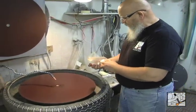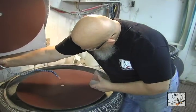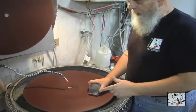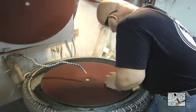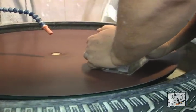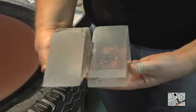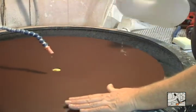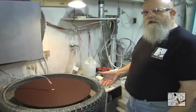I'm going to change direction so I'm sure I'm getting adequate coverage and grind. For an older pad I'm going to use a little less water — this small amount of water is good when it's an old and worn out disc. When you're done with this wheel, it's very important to rinse it off, because any ground glass remaining on the wheel will dry and form a crust that will cover the diamonds and make it less effective.